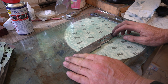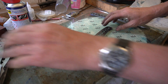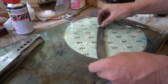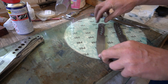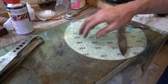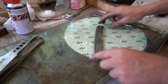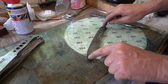I've got a little bit of pre-heat treat straightening to do. These knives have all been finished up to heat treat standard. The last thing I do before I heat treat them is make sure they're all flat. I want them to be flat like that. I've got a piece of half-inch plate glass here, and I can see there's quite a bit of rocker on this one. That side feels as though it's flat but it's arched. Turn it over and you can hear it quite clearly.